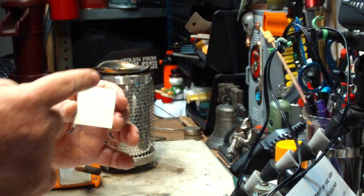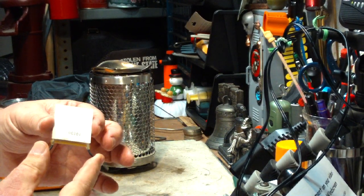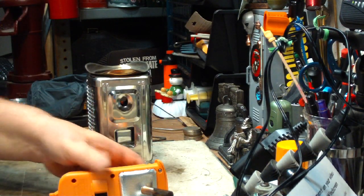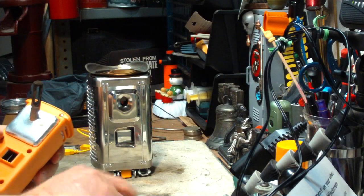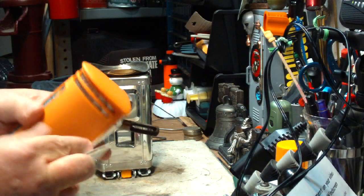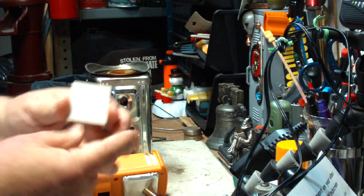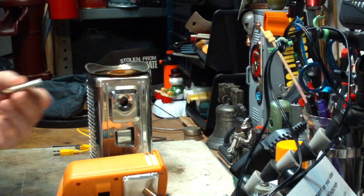So you can either make a heater or a refrigerator with this by adding current. The really neat thing is, if you heat up one side and chill the other side somehow, you can generate electricity. And that's what they're doing in here. So this part heats up this surface, and they've got a fan here that sucks air in, pulls it down and shoots it out. The air goes past fins that are cooling off the other side — heat on one side, cool on the other, and the difference makes electricity.